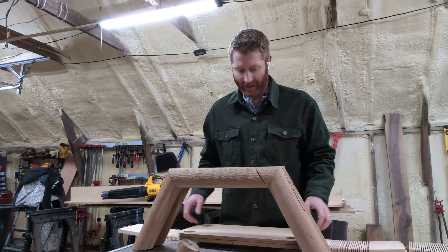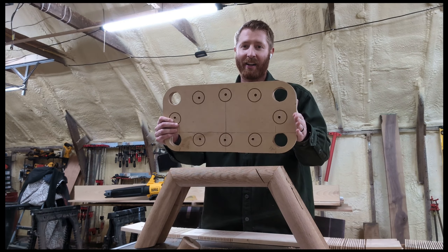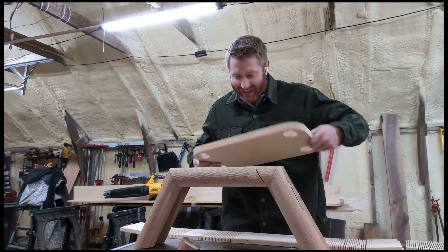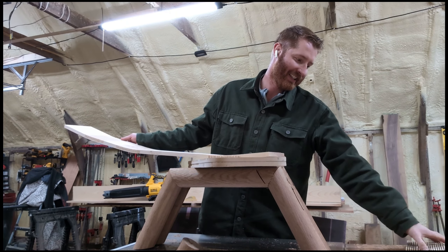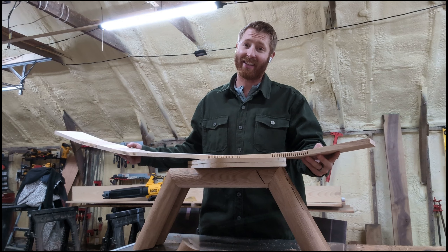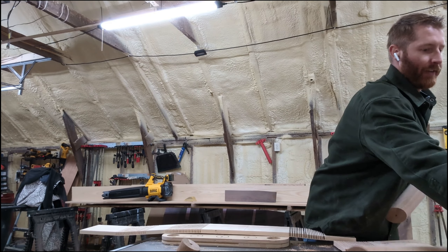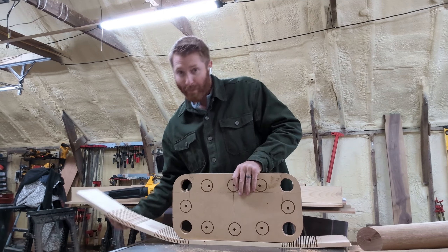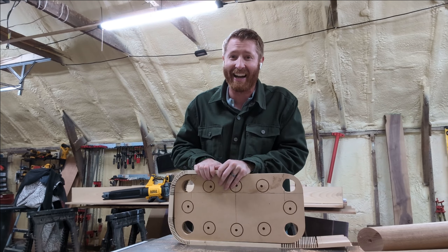I'm pretty happy with these legs and I cut out a template on MDF for what I want the actual cabinet to look like — a lot of new things for me. Cylinder legs first, and curved corners is also going to be a first for the shop. I did a test run on some kerf bending — brand new to me — and I almost got my entire piece cut, close to a hundred cuts, and then right near the end things went south. I had literally two cuts left and I had a little kickback with my track saw and it just broke right through. But the idea with kerf bending is creating a bunch of cuts and then taking your lumber and bending it around your form. This to me is so stinking cool and I hope I can pull this off.